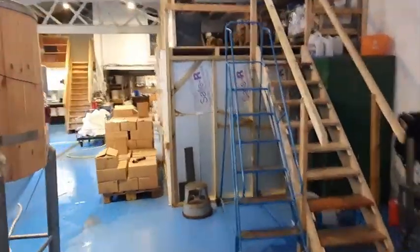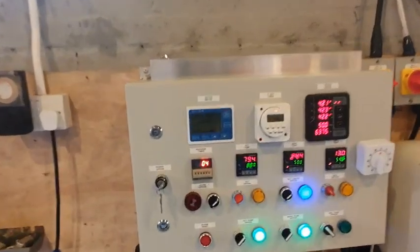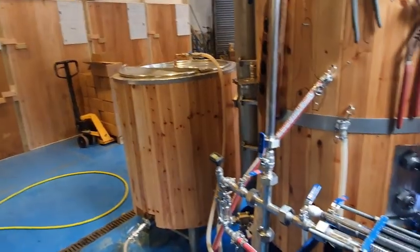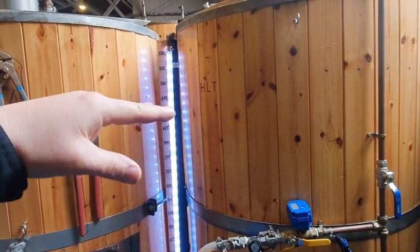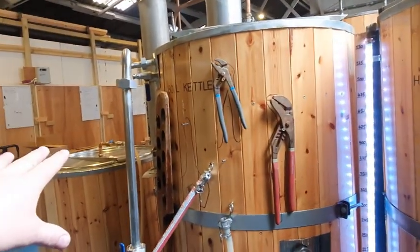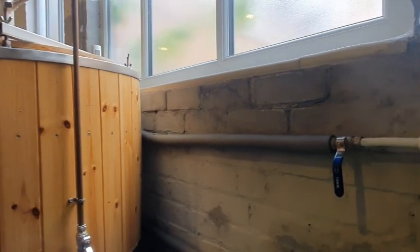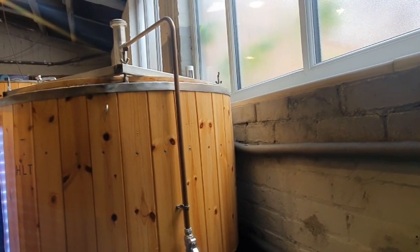Gemma's turned off the CIP pump so I can talk to the camera. We've got a water meter on the control panel and this regulates water from the HLT through this flexible hose into the mash tun - it does exactly what it's meant to do. When the HLT has been drawn down we need to top it back up, usually with about 100 to 200 litres to make our sparge volume. The HLT heats that water back up whilst we're waiting for the mash, and usually I just open that valve and the tank will fill. It also has a stainless steel ball cock from GC Supplies to prevent overflowing.